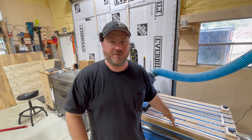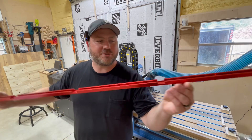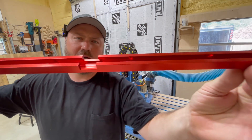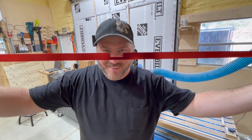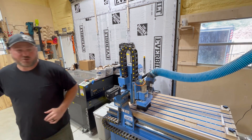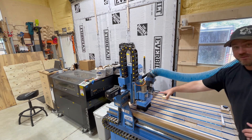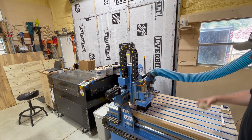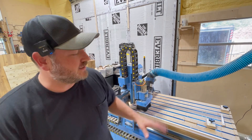It's time. The last flattening pass I did almost clipped the screws that are holding this thing down, and the screws are just into the MDF underneath. We're gonna change that — we're gonna go with threaded inserts. We're also gonna install some interesting new t-track from Armor. It's got little pass-throughs right there, so instead of having to join stop blocks all the way at one end you can just, you know, get it. Without further ado, let's dive right in.